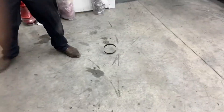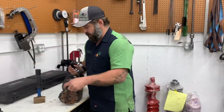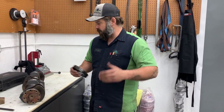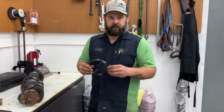Bam — that easy. Knocks the sleeve right off, doesn't do any damage to the crankshaft. I got that right out of a Caterpillar service manual — they have some very good engineering and simple tricks right in the manual. Hopefully that helps. Thanks for watching and see you next week.